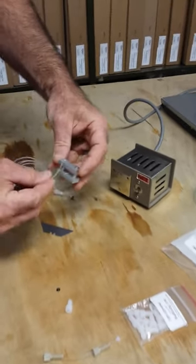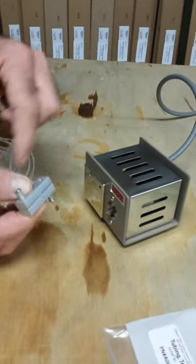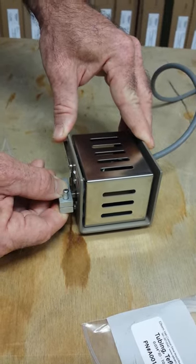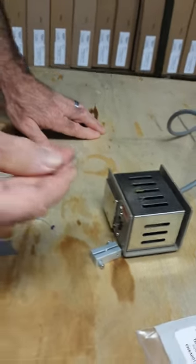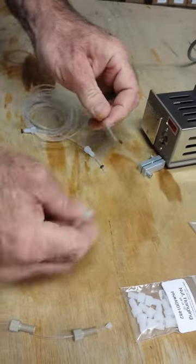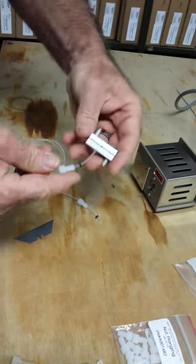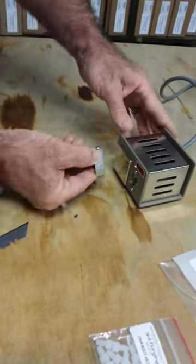To do this, you have this device here, and you put the tubing in the little sizing hole that is there. You put it on the little bar which has little teeth that hold it — run it a little long — then you put it in the sizing hole, make sure it's straight up and down, and slide it over the hot flanging device, counting one-two-three-four-five, one-two-three-four-five.